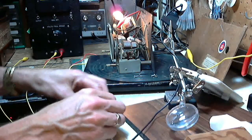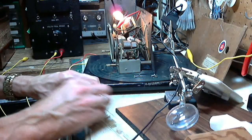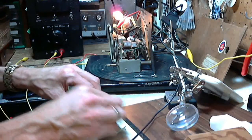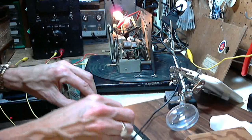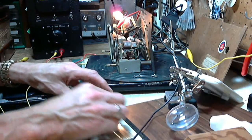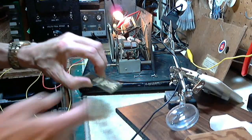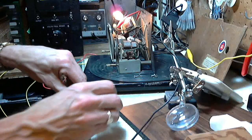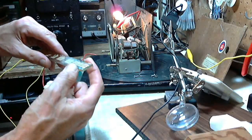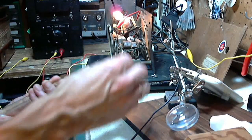This one's very rugged. Yeah, very little worry about cleaning it. And another way you can be fooled on these glass things, especially the complicated ones, this one's really simple. It's clearly just all on one side. On the much more complicated multi-band radios, sometimes there's print on both sides of the glass, and so you can become quickly convinced, oh, the print's on this side. Flip the glass over, soak it with your cleaner, and wipe off a whole bunch of words before you even know what happened.